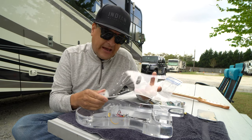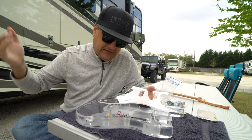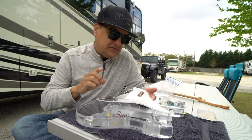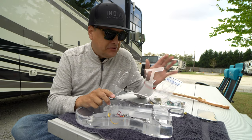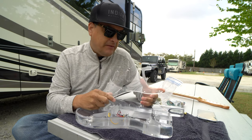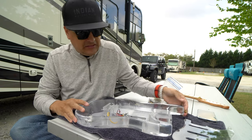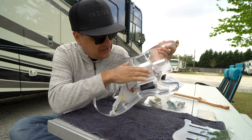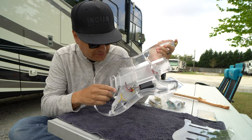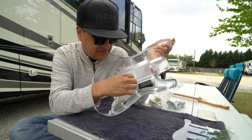We're going to trace it on paper, get it perfect, and have them cut it out — it'll be a white-black-white pickguard. I like that idea because the body is machined and you can see the tooling marks in it, and also the wires. So I'm going to do what I can when we put this guitar back together to minimize the number of wires visible in here.